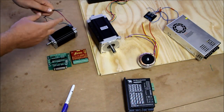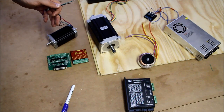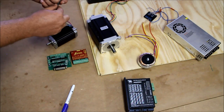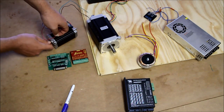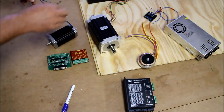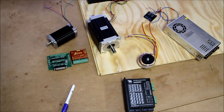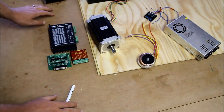It doesn't matter if you put it on A or B because in the software you can reverse direction. However, if you're running four motors I'd suggest keeping the coloring consistent — it's easier to program and less likely you'll wire things incorrectly. Take red and blue together and hold them — it goes notchy again. So now I know which pairings are working. I use four-wire motors; six and eight wire I haven't covered, but that's a handy trick to find out coil pairs without needing a manual.